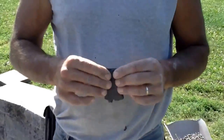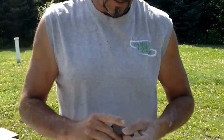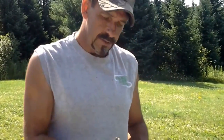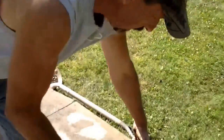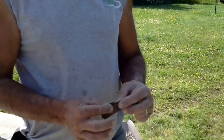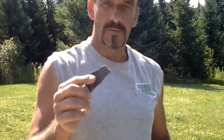Now, this is an old trick that was taught to me by a gentleman that worked for a major brick company. You know, you get these 30-year shingles, and you just break this off, raise up whatever corner isn't working, and you can slide this right underneath. So basically it's a shim is what it is. They're thin enough you can add 1, 2, whatever you have to, plus they'll last forever because, you know, they're shingles. Okay, so just a little trick to help you out.